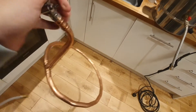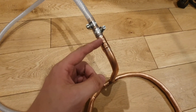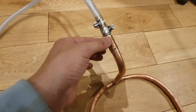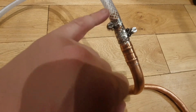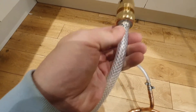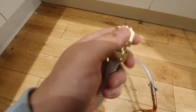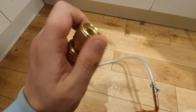The holes are drilled in the bottom. I've had to put a 15mm to 10mm adapter on just so I can slide the 3/8-inch pipe over it. Then I've put a couple of inches of 10mm pipe so I've got something to fix onto the jubilee clips. On the end of the food grade 3/8-inch hose, I managed to warm it up using the kettle to slip it over the hose fitting, and with that being brass it's nice and tight as well - so easy clean.